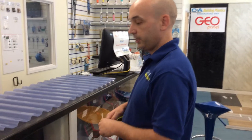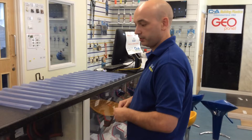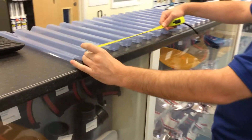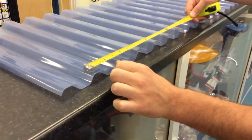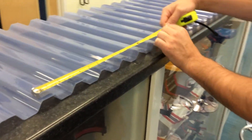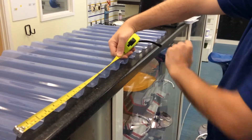The best thing to do when measuring your pitches is to get approximately ten crowns. You then measure from one pitch across — pitch one, two, three, four, five, six, seven, eight, nine, ten. So you measure from the first crown edge all the way to the tenth.